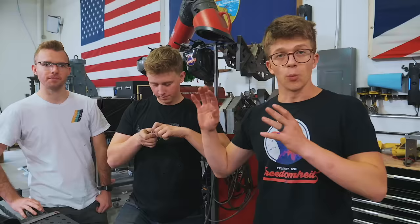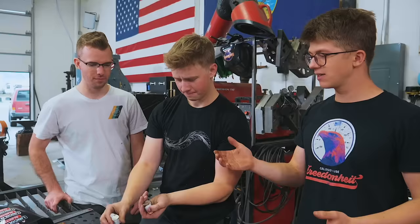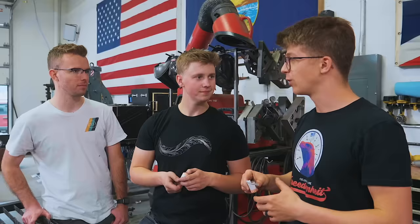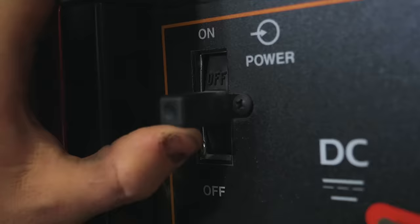Okay. So Patrick's piece of Makume from the quarters is cooling down, and we're gonna be able to start machining that into a ring. But what we do wanna do is see how we can actually avoid failure with the Makume. So this time, we're gonna be making up another stack and TIG welding it. But we're then gonna heat it up in the forge and forge it together under the power hammer. See if we can get a more solid stack. Hopefully we get a billet that we can do some more interesting pattern work on. So let's get started with all of that.